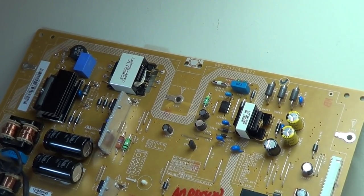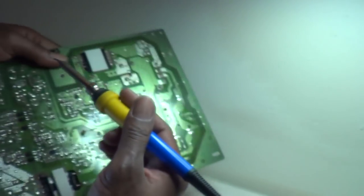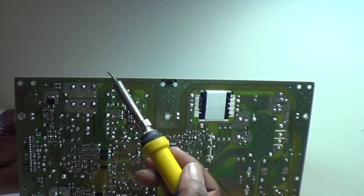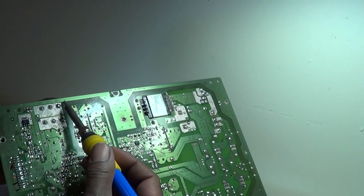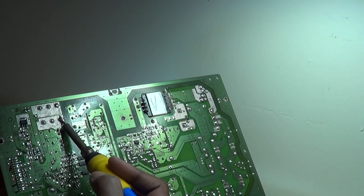So I'm going to pull this one out. I got my soldering iron here. This diode is up here — I'm just going to go back and forth and pull it out with my hand since I've already pre-heated it. Just heat each side and pull it out. Usually that's easy in most cases. If not, just put some solder on each end to loosen the rest of the solder up and you'll be able to do it just like I just did. Let's double-check this diode.